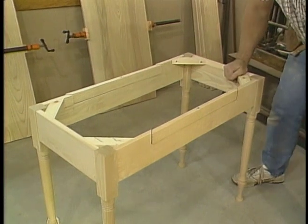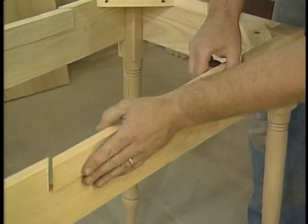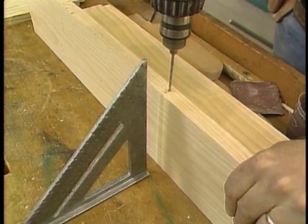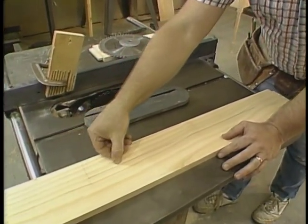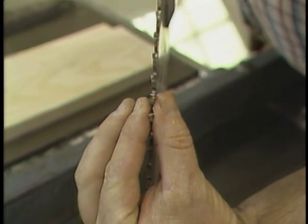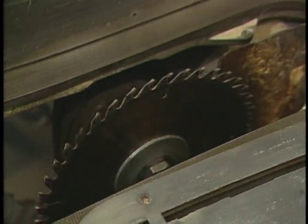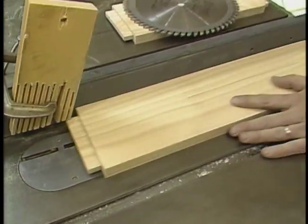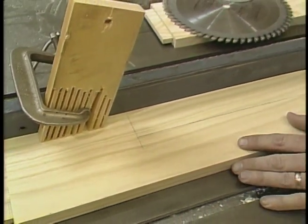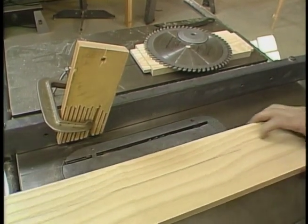Now back at our prototype base for the table, the side style and this swing arm are cut out of the same piece. They're mitered at the ends to act as a self-stop. The first thing I want to do is drill a hole for this screw. To make the cut along the bottom of that support piece, I have a couple of tricks: I don't want to use my standard saw blade because it has too wide a kerf — it's going to remove too much material — so I found a blade that's a lot thinner and still carbide-tipped; this blade actually comes out of my circular saw. I'll slide my piece in underneath this featherboard, which holds the piece down and keeps it from kicking back. I'm going to raise the blade up slowly through the wood and then push it through to my final mark, shut the saw down, lower the blade, and take the piece out.